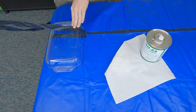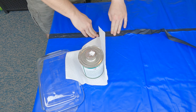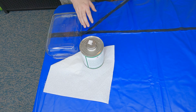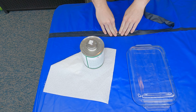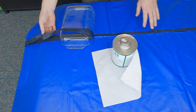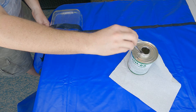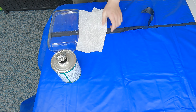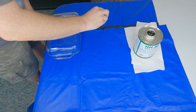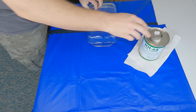I use some wide electrical tape to temporarily seam the old bag and the new bag together. With the seam temporarily taped together, I flip the assembly over. Interestingly, the new dunnage bag appears to be a few inches longer than the old ones. However, I proceed despite the length discrepancy. Just like in my previous video, I use strips of vinyl I cut from an old busted air mattress. I use HH66 vinyl cement and the brush attached to the can lid to glue the strips down, bonding the bags together. I glue the seam quite quickly. I use the bottom of a glass baking dish as a nonstick surface to slather glue onto the back of the strip, just prior to bonding the wetted section down.